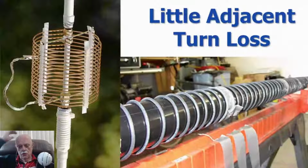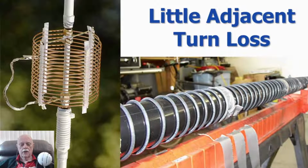And here are two very efficient loading coils, again, homemade. One on the left looks like about a 2-to-1 spacing, and the one at the bottom looks like about a 5-to-1 spacing. These are efficient loading coils with very little additional resistance caused by skin effect.